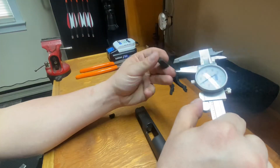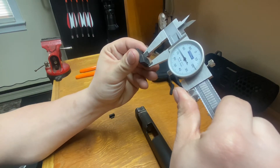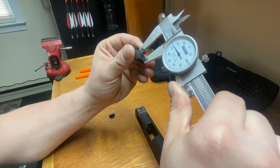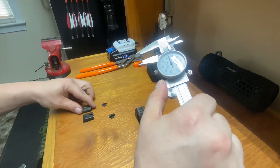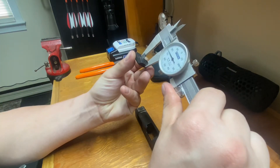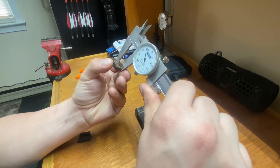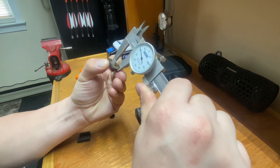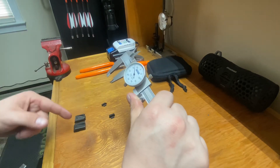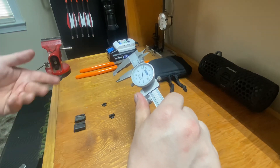Our new sight is going to be 0.474 inches. So that's 0.007 inches bigger on the old one. You don't have to file-fit it because the new one is smaller, so it's still going to be a tight fit but it'll press in just nice and easy, and it's got the set screw to hold it down. So you'll be fine with that.